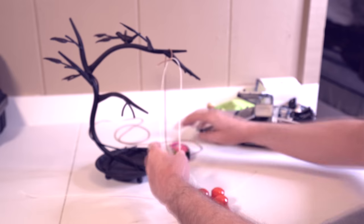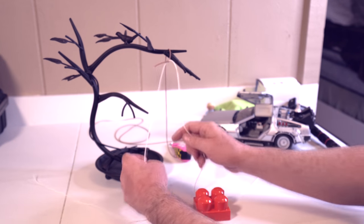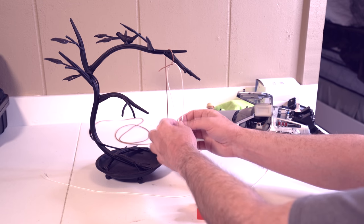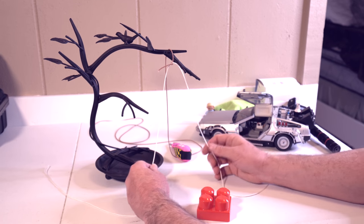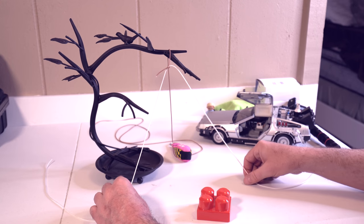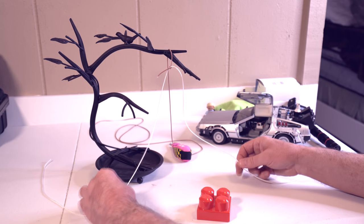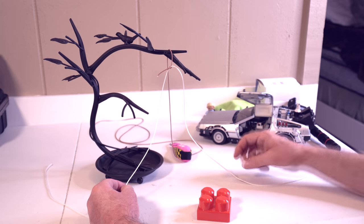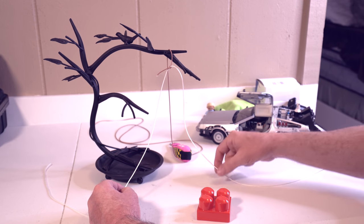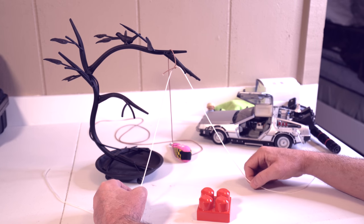Guess what happened? So, just so you know, I love inverted Vs. They're freaking awesome. They do a great job. But this started happening. They started twisting. I finally got them out. And guess what? Now you've got to do something. You've got to do another contact point and another contact point, and it needs to be up off the ground. So what do you have to do? You have to have another insulator between here and your antenna, and here and your antenna, right? Here's your inverted V, right there.